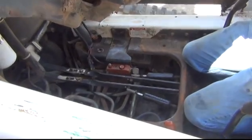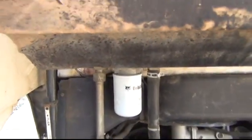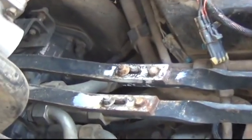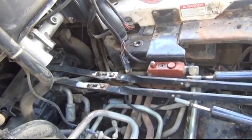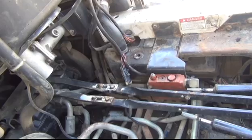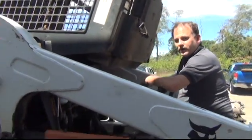The other one bottoms out in the frame first. So what we want to do to fix the specific problem Pete asked about is loosen these bolts, shorten that linkage, and tighten the bolts so that when you move the lever forward it pulls the pump lever farther forward. The machine is going to drive farther on the left, and presuming the right side is driving at full speed, once we get the left side also driving at full speed it'll drive straight. So that is a simple steering linkage adjustment in this situation.